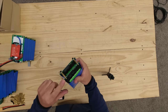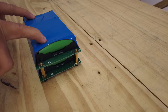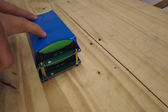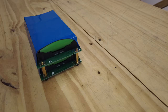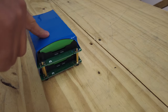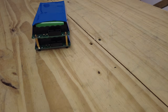By doing that you've electrically connected these two boards. These ship with brand new cells and are available with LG M36 cells and NCR 18650B cells — you have a choice of 3500 milliamp-hours or 3400 milliamp-hours, capable of 5 amp continuous. The cells ship in factory packaging at 30 percent state of charge, so they are all exactly the same voltage and very close in capacity. Once you add another board, you use four standoffs to secure it.